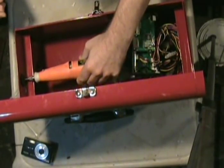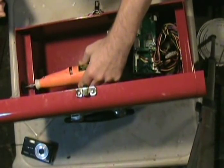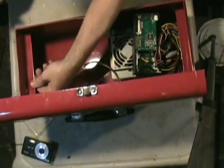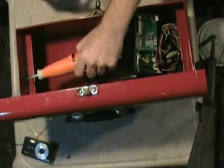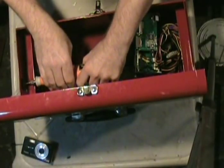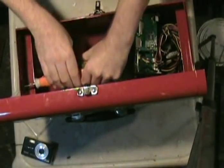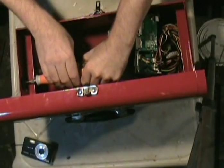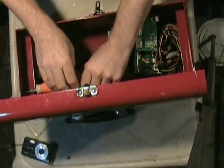The first step you want to do is, as you can see, I'm grinding off the edge on one side so I have room to mount a fan down there because that's going to get in the way. Just take your Dremel, grind it off, and eventually either cut all the way through it or just weaken it enough so you can bend it off. The main thing you've got to worry about is be careful about the metal splinters that come off. All the metal dust from grinding in that case — if that gets into a hard drive or your power supply, it will short something out.